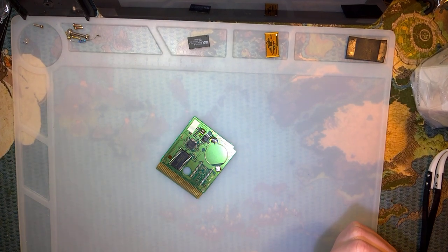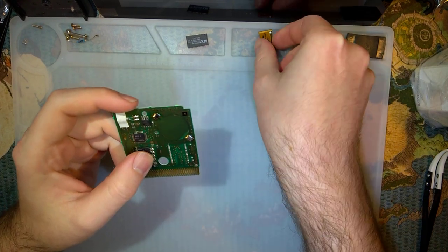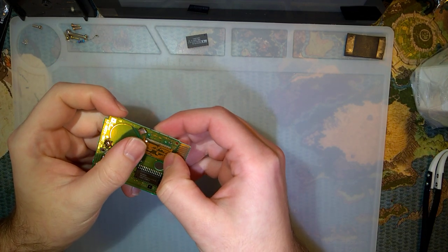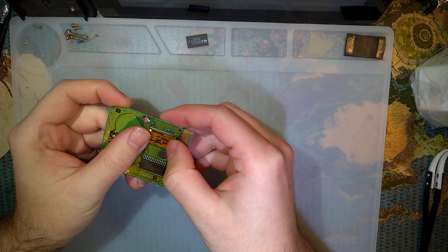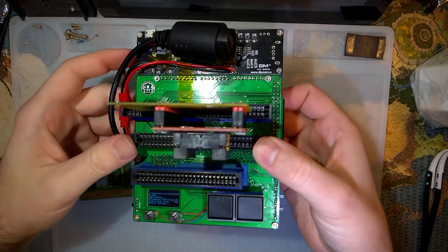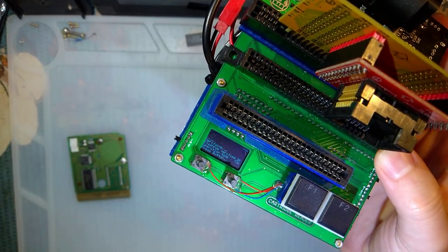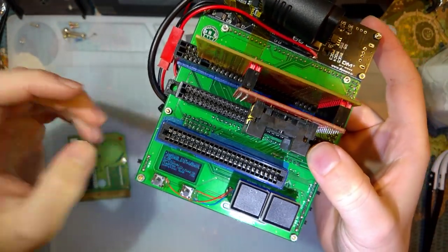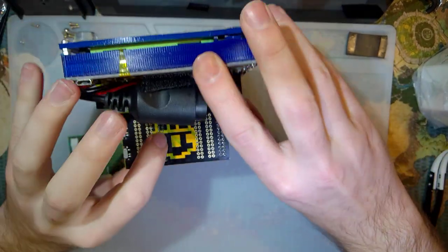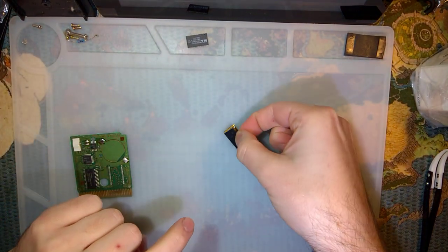Right, it's still a little bit warm, but I think I can work around that. So now I just need to solder this adapter onto here, which should be pretty easy, but I think it might go better if I solder the flash chip to it first. I've got here in my flasher, if you can read that screen, maybe, maybe not. There we go. It is already pre-flashed with Pokemon Silver. It's just an AM29F016B chip. But this just goes on here, line up the dot with the dot there.